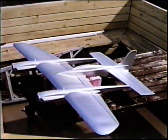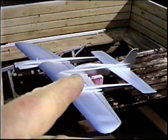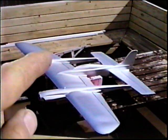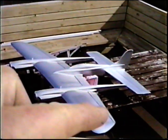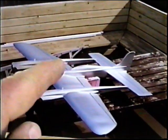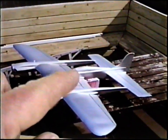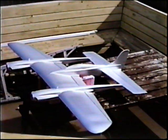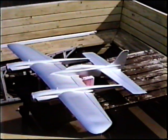Now I just can't wait to see. I hope Ken is going to get some video for us. One of the problems we've really got, we'll see how Ken's worked out, is connecting all these flaps. On a B-25 there would actually be four flaps, and they have an anhedral-dihedral break, so we're going to try to get some of those flex joints this week. They're aerospace quality, and we're going to try to use them. I don't know how Ken did this with multiple push rods or what, but we'll see how this all worked out.